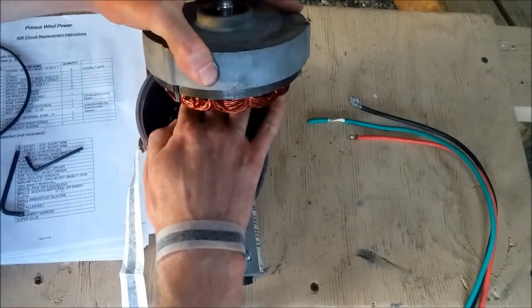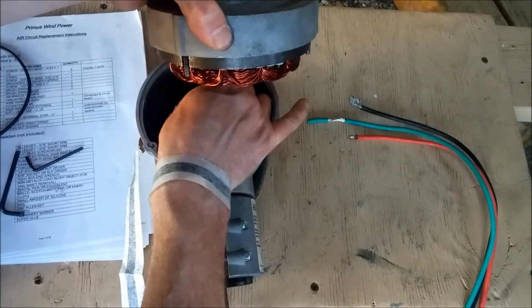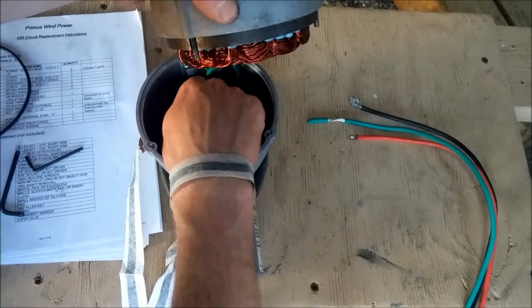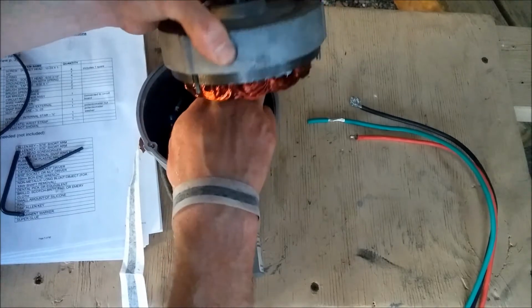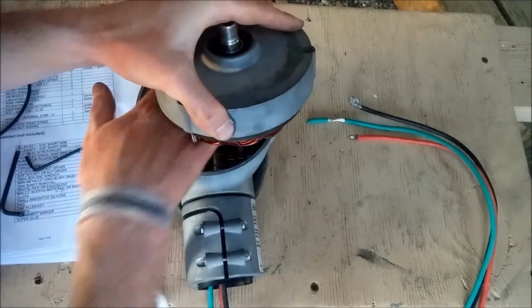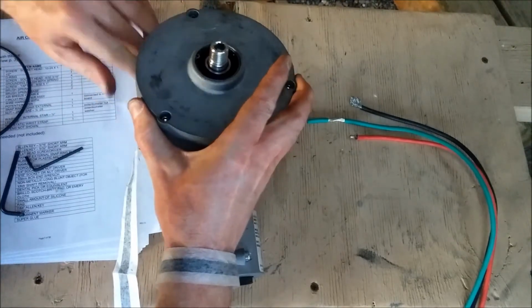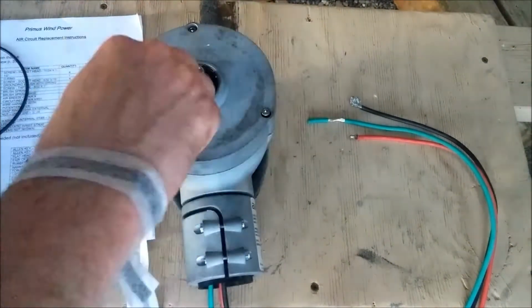Push the 3 stator wires into the body so they will not interfere with the circuit, yaw shaft, or rotor. As you assemble the alternator assembly to the body, be sensitive to grabbing. Grabbing can indicate the stator wires are interfering with the circuit. Make sure that the wound stator wires do not contact the body casting. Loosely thread in the face bolts.